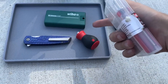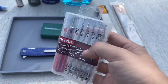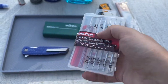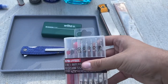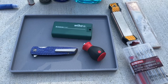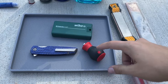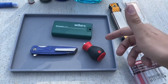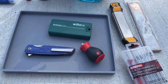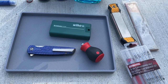You don't have to buy the expensive Wiha stuff, although I highly recommend it because the cheap bits - like this one from an auto parts store - will strip. If you have a really hard screw, it'll either strip the bit, most likely, or strip the screw a lot easier. So I highly recommend spending the $20 it costs to get good Wiha bits. I don't think I've ever fully stripped a Wiha bit.